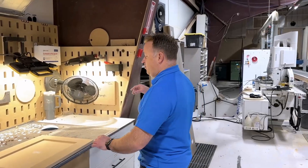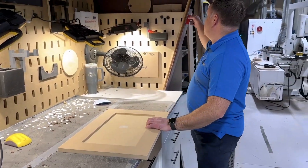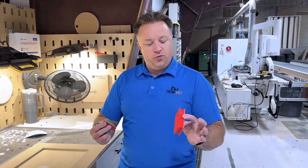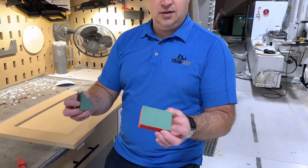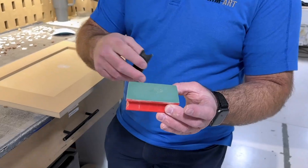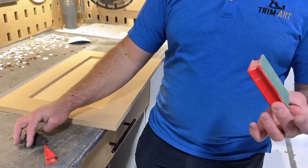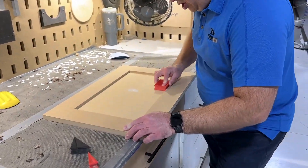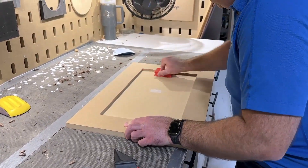So I want to show you really quick how we sand an MDF door. First thing we do, we grab our door and we want to just hit the edges really quick. We've actually — we love our 3D printer. We've 3D printed some little tools to get into the corners different ways, and we just use sticky sandpaper and then we can hold them. Depending on what door style it is, or if we have sharp corners or things. Typically what we do, we go in on the edges here, get that edge a little bit.